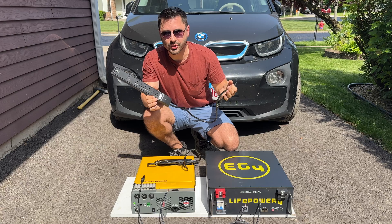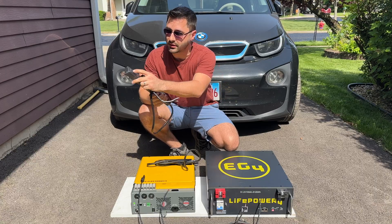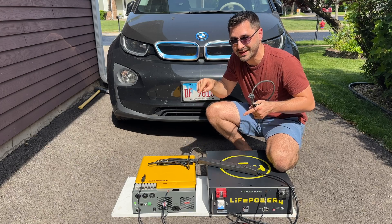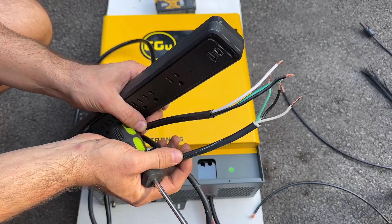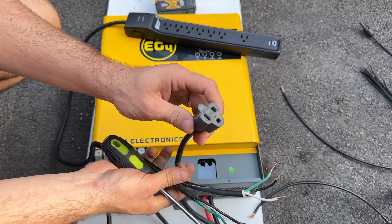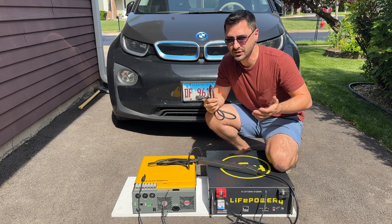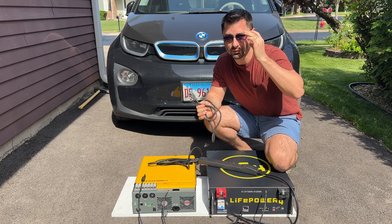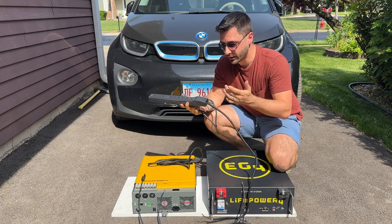The other half of the power strip will be our distribution box, providing protection with a built-in surge protector up to 2100 joules. It also has built-in USB-C and USB-A, and a bunch of outlets. If you'll be charging your EV like I will, it's a good idea to wire in a dedicated plug for it using another extension cord cut in half. The internal wires must be at least 12 to 14 gauge depending on the charger — in this case 14 gauge, so you probably don't want to go over about 1.3 kilowatts when charging.